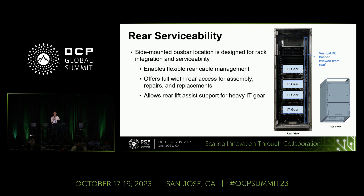We think about ergonomics, safety, and maintenance when we design our racks. One key feature is the side-mounted bus bar, which is different from option one where the bus bar is centrally located. We like this approach because it provides full, unobstructed access to the rear for ease of integration. Since this rack is quite deep, installing equipment from the back rather than reaching through the front is practical. It also provides clear access for performing repairs and replacements in the field, including support for external electric lift assist for heavy IT gear.